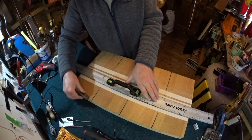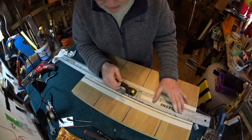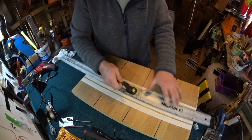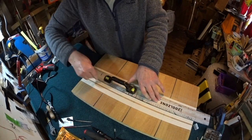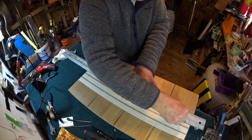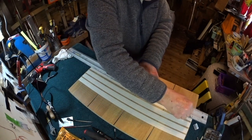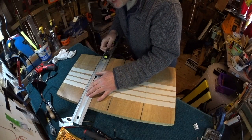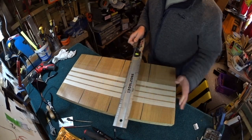So there's an equation for that, and like I said, the most important variable that gets entered into that equation to determine where those frets fall is the scale length. So all necks with 25 and a half inches have the 25 and a half put into the equation, and lo and behold, the position of the frets comes out the same on all 25 and a half inch necks. On a shorter scale length, you put in your 24 and three quarters or whatever it is, and guess what? The spaces between all the frets are slightly different, and they get closer together as you go down the neck at a different rate. So the standard neck is manufactured, like I say, usually to one of three or four or five different standard scale lengths.